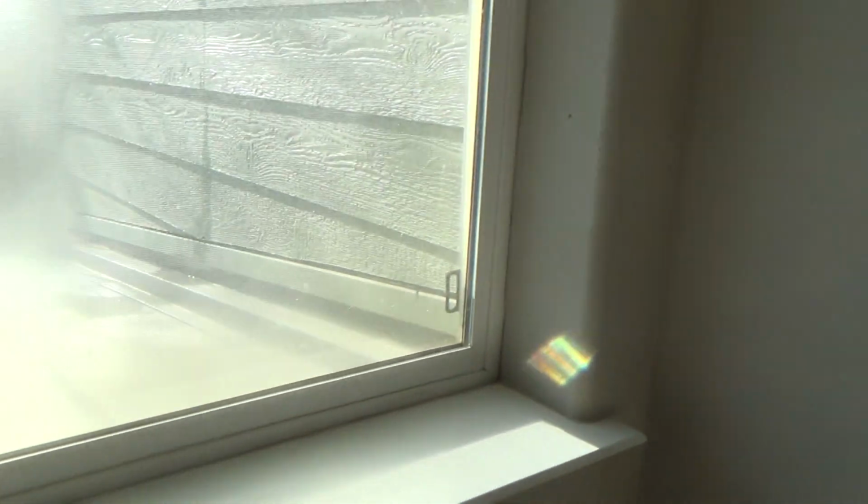If I got the time, I'm going to take out all the loose bits, and I'm going to clean off this white window frame edge and get all this stuff out of there. Now is the time to do it before I caulk. Okay? And some people will paint first. I'll clean this, and then I could paint this. Then I could put caulking after. But that's if you're painting white. You know, if your walls are off-white or something.